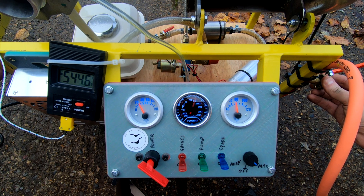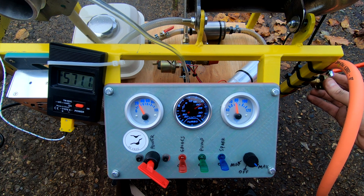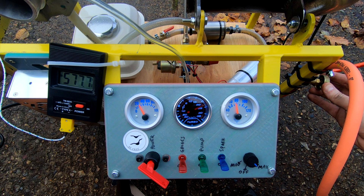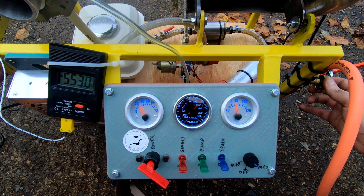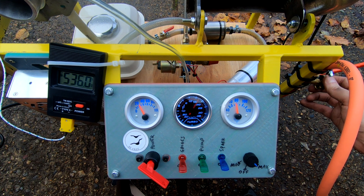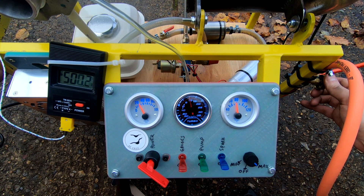Having watched other YouTube videos again such as those from Tech Ingredients, I have decided that my initial hole pattern was probably correct and it was more likely an issue of the fuel supply resonating. I have a long feed hose that could allow some resonance in the incoming gas, as well as the possibility of the gas recondensing into liquid through the throttle valve and spitting liquid propane into the engine.